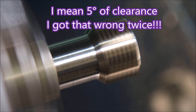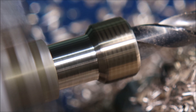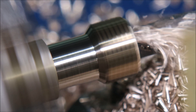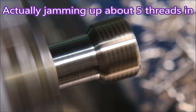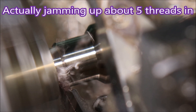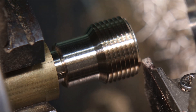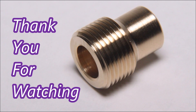I have to admit, when I was cutting these threads — and I like to think I can cut good threads, and that's why I use full profile inserts — but this part was jamming up in the tapped hole that I'd made as a test nut. I found that actually the pitch was wrong; well, the pitch was right, but the lathe wasn't cutting it correctly. So I had to actually adjust the pitch to suit the speed we were cutting at. There's the finished parts — quite pleased with them. Thank you for watching.